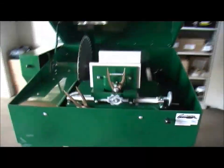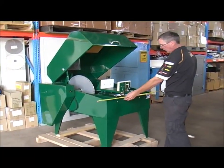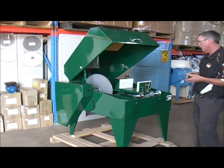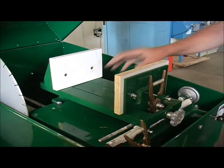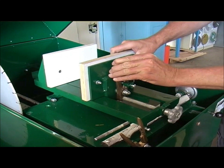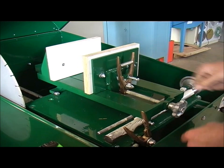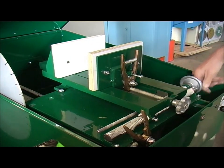This is a Covington 20 inch machine — a little bit heavier build, you can see just how much bigger it is. In the structure it's 900 millimetres wide and you might need 1,100 deep for that machine. Much larger vise assembly — we always buy the large vise on those units. You can actually buy a smaller vise but it gives you the flexibility of using the bigger stones. Quite a simple vise arrangement; the vise can be locked into position so that thread won't come undone. Same cross feed with quite a large adjustment in your cross feed area.